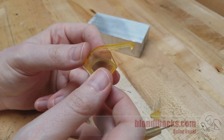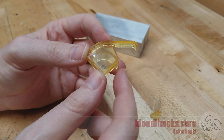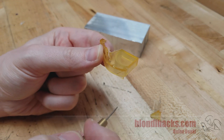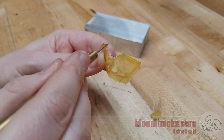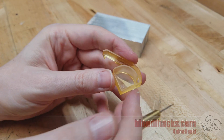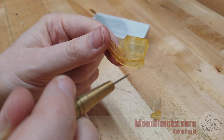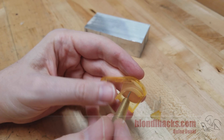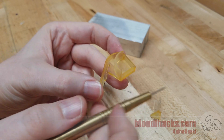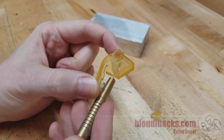This part is actually a really good candidate for a single-part mold because it has one side that's completely flat all the way across. Normally with a single-part mold you put the flat surface up, pour the resin in, and it self-levels across the top — all the details end up underneath. However, because of the shape of the recesses, we'd get a lot of air bubbles pouring silicone over it, so we need to cast the silicone with it facing down yet somehow end up with the mold having a flat top underneath.